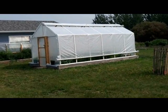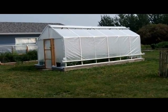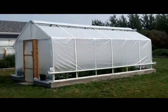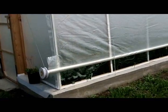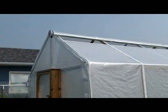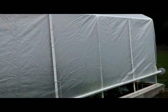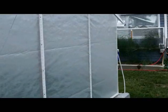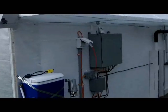This is the latest greenhouse I've been working on to automate. It's a lot larger than my previous greenhouse automation project and more advanced — it's got variable control instead of just an on/off fan. You can see it's got louvers both on the top and the bottom, connected via steel cable, so when you open one they both open and you get a nice convection flow. It's all controlled with the Arduino control package I put together.